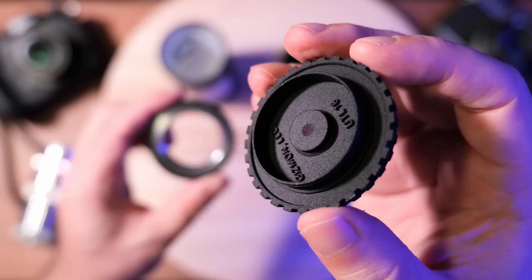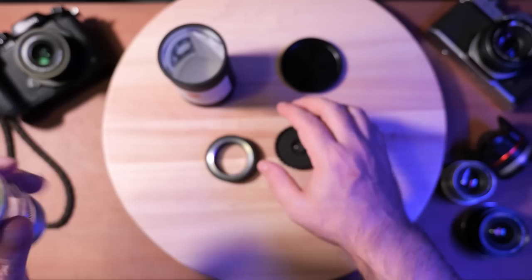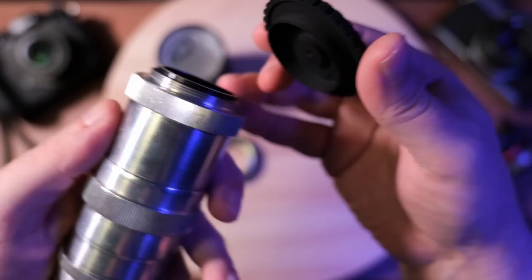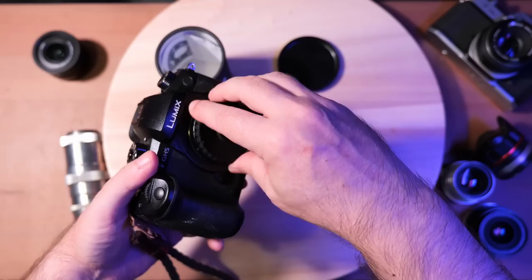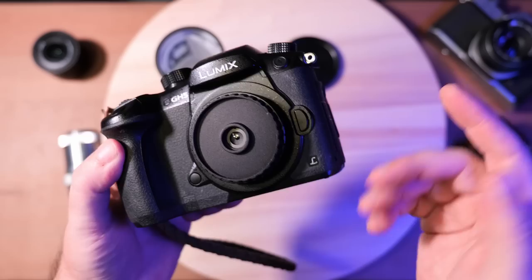Gizmon have anticipated this in their design. Instead of designing the lens to fit directly on a range of cameras, they've printed it with an old school screw mount — what is known as an L39 mount, in fact the same mount used on some of my 60-year-old rangefinder lenses. The screw mount itself will wear better over time than a modern bayonet mount will in a plastic material, but then they supply a nice high quality metal mount adapter. The idea is to basically leave the lens in this adapter permanently, so the fully metal mount takes all the wear and tear from mounting and unmounting on the camera, thus protecting the plastic from excess wear. This simultaneously solves the fragile 3D printed mount issue and lets them manufacture one mount for multiple camera bodies — all they have to do is pop in whatever appropriate adapter for that particular customer.